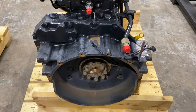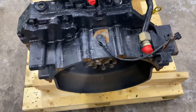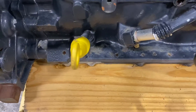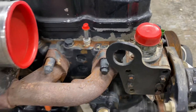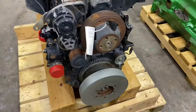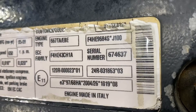We're selling this one to a guy for a forestry application — a log skidder. A couple things we've learned: the rear cover bolts on, so it's interchangeable. The dipstick was in a different spot but it had the boss for it. The turbo return line was the same, water jackets were different, but everything looked like it was going to bolt up, so we think as a long block these are going to be the same engines.